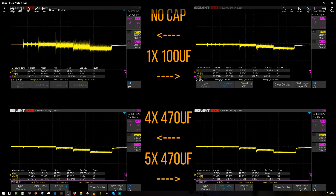One fat low ESR capacitor — even just a single 470 — is very good on your quadcopter. With five low ESR capacitors it only had a voltage spike of 0.2 volts. That is ridiculously crazy — insane. The voltage drop is the same as the four-cap configuration at 12.4 volts, which is still good. Without anything, it went down to 10 volts, so there's a clear improvement.